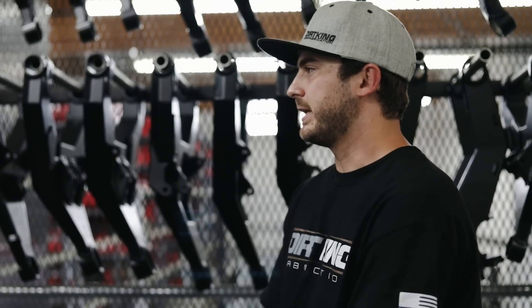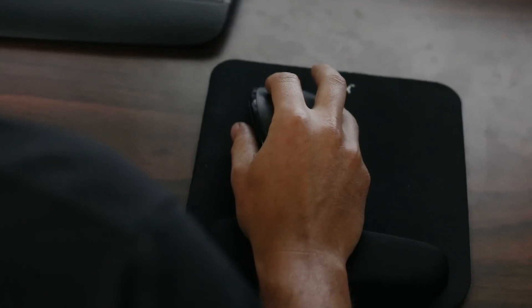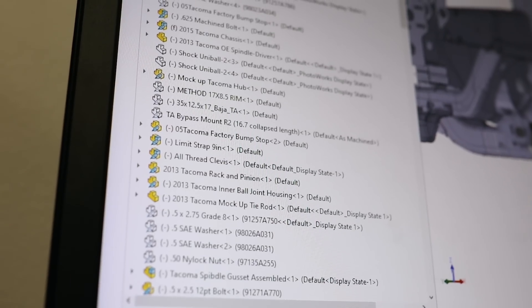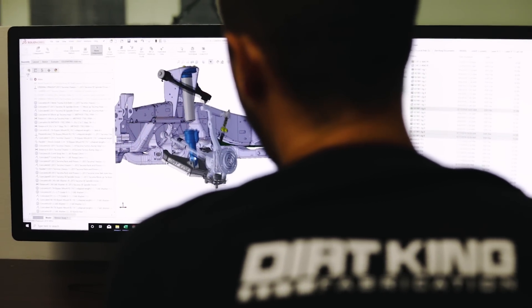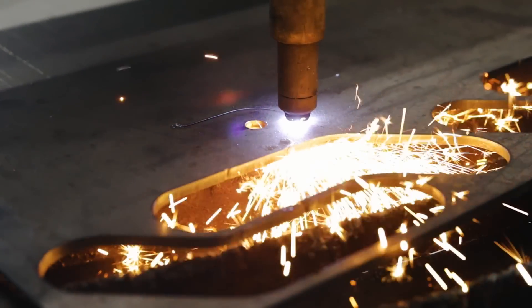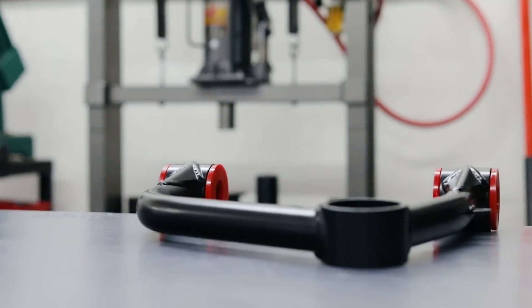The process that goes into building these things just fascinates me — the fabrication, the engineering behind it. There's a lot of steps in making a new product, and that's why it takes a little bit of time to release these things. Where it all starts is in CAD — we start the concept of what we're trying to achieve, go into CAD to see if it's achievable, finalize everything, then build the prototype. From there we're validating our CAD to see if what we designed really works in reality. Once we validated it, we go back to CAD and turn that prototype part into a production part. We send it off to laser, get it in a pallet of laser-cut parts that are all press-broke and ready to be welded up, do a production run, send to powder coat, do final assembly, and then it's ready to ship.